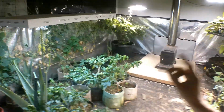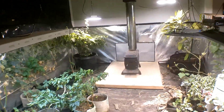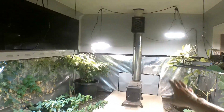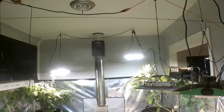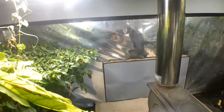And then down here is pond liner. I laid that down ultimately for a permanent floor and keeps the water from getting underneath, with tape on the seams, the Gorilla Tape. And then there is my wood burning stove. 2x4 built the frame around it. The insulated pipe is a heat exchange, magic heat, and there is pea gravel and sand underneath these bricks. I'm just now finishing it, so it's still a little dusty with sand. It's filling in the cracks. There's a shield back there, which protects it from burning the wall.